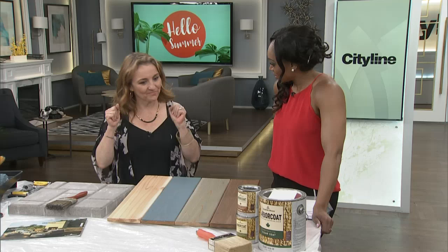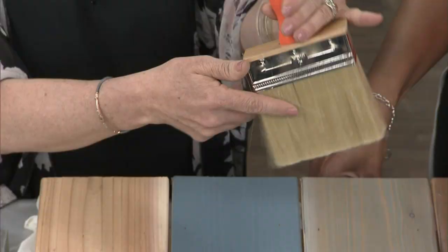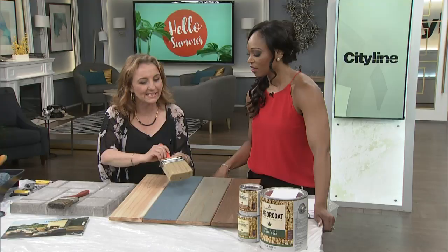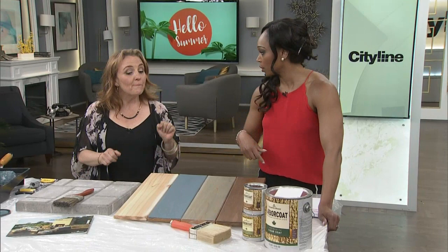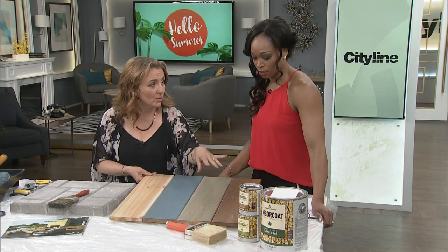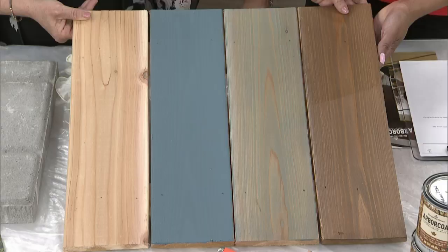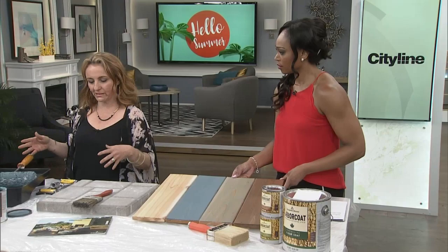Now it's in much better shape and you can stain. When staining, especially semi-transparent, you want to use a staining brush as opposed to a roller. The cool thing is it holds a lot of product and you can put it on a pole so you don't have to get down on your hands and knees. You want to push it into the wood and go with the grain, not against the grain. Also, on a decking surface using waterborne Arborcoat, you want to use a clear coat — it's like sunscreen — and you can apply it every year to refresh your deck instead of redoing the whole process.